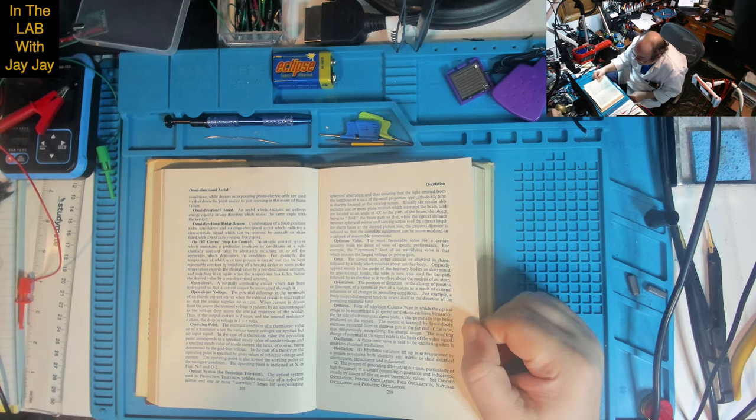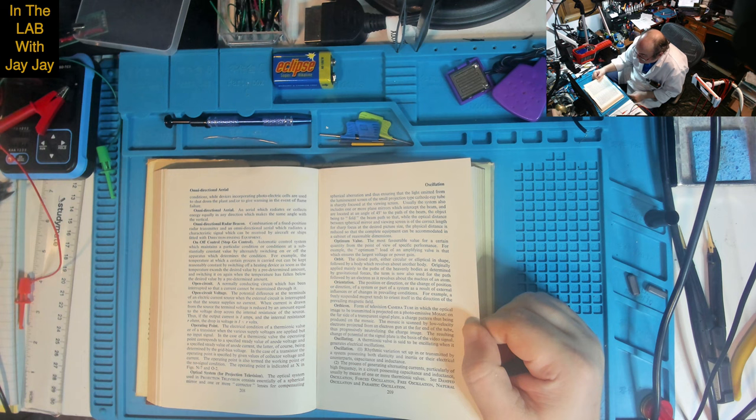Omnidirectional aerial, omnidirectional radar beacon, on-off control, stop-go control, open circuit voltage. The potential difference at the terminals of an electric current source when the external circuit is interrupted so that the source supplies no current. When current is drawn from the source, the terminal voltage is reduced by an amount equal to the voltage drop across the internal resistance of the source. Thus, if the output current is I amps and the internal resistance R ohms, the drop in voltage is I times R volts. Operating point,